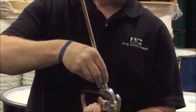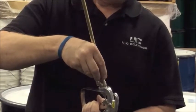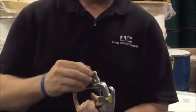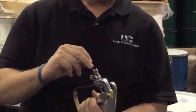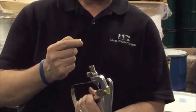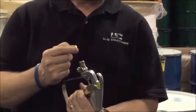Slowly and gently unthread the wand, making sure that this small seat valve that sits between the mouth of the trigger valve and the wand stays in place and stays in position. Its positioning is critical.